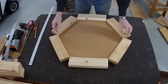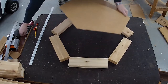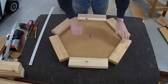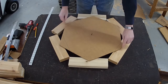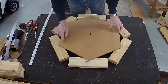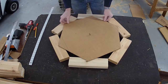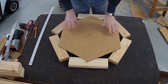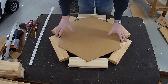Once I've got this in place, I have to put the next layer down — and that's the next question. I have to get this up out of here, so first I can put a handle on it. Now I need to rotate it just the right amount. There are a lot of degrees of freedom here. You can draw centers on the boards and line those up, but that's a little bit tricky. So I have another idea: what if I build a second pattern that drops in behind this one and lets me index to the last row before I make the next row?